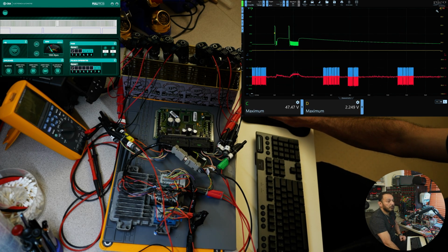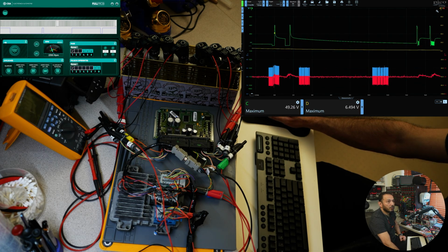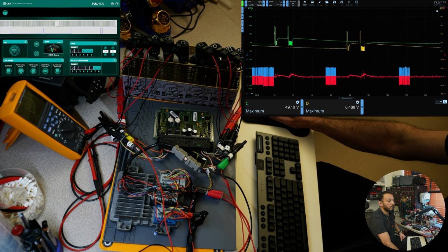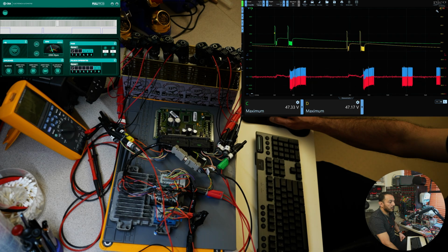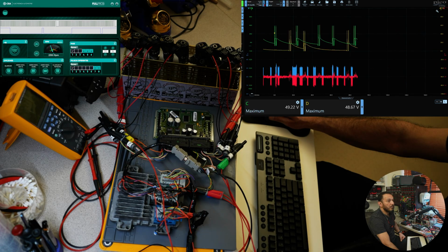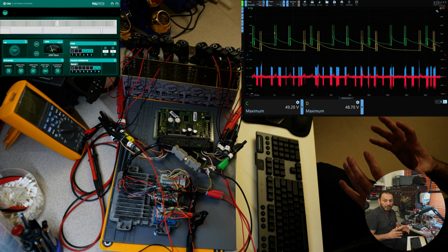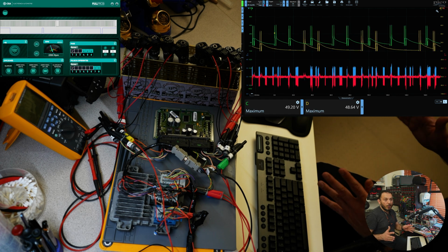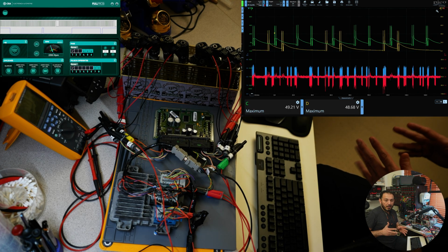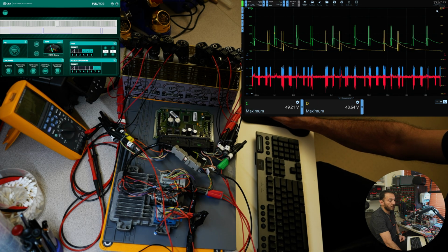All right, but let's raise the RPM so we can see. Well, right now that was a little too much. We're not changing throttle position and so on. But everything is working good. So let me change my timing so we can see that we have multiple activations. I'm just changing the timing on the screen capture for the oscilloscope so we can see more of those spikes on the yellow and on the green. That means the injectors are running perfectly all along, no misfires, no nothing.